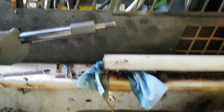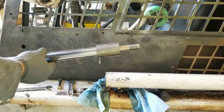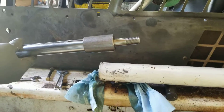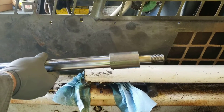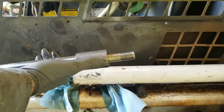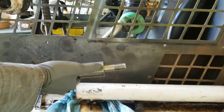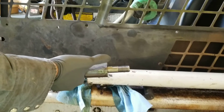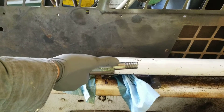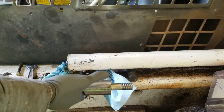Oh, and there's a problem. There should be a nut and plunger on there, but that nut and plunger has come off inside the cylinder. So we're gonna have to fish that out — that may be the main problem we have here. We may not have to put new seals on this at all. This nut apparently has come off and there's a spacer stuck on there. We'll have to free that up. It'll probably solve the problem of why we don't have any power in this lifting arm.